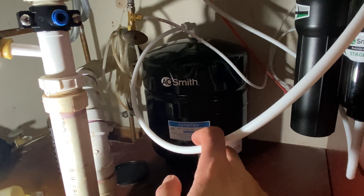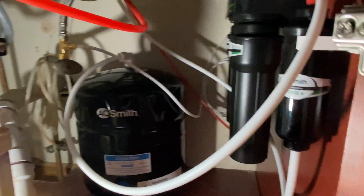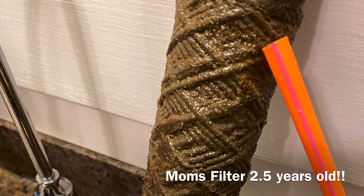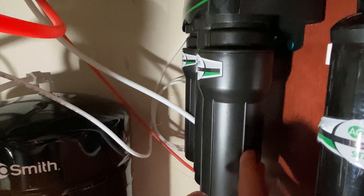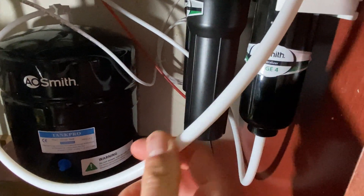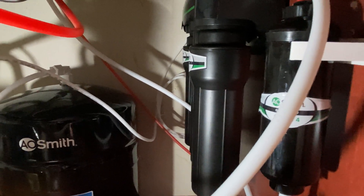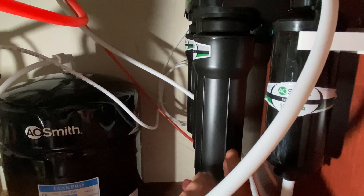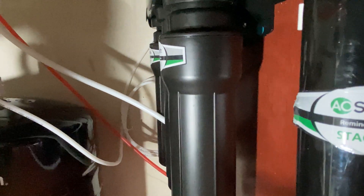If you have less pressure coming from above and you have the correct pressure in the tank, there could be one other thing: dirty filters. If you don't change these when they're supposed to be changed, they get clogged, and that could start to cause buildup in your lines. So make sure you change these when they're supposed to be changed. Very uncommonly, there could be a crack in the holding tanks for the filters — and that obviously you could see. So that would be something you could see right away.